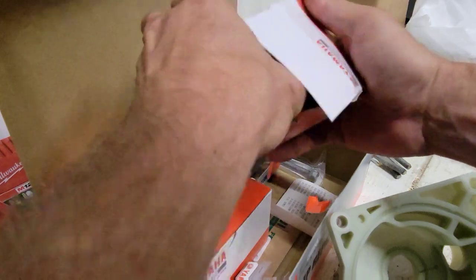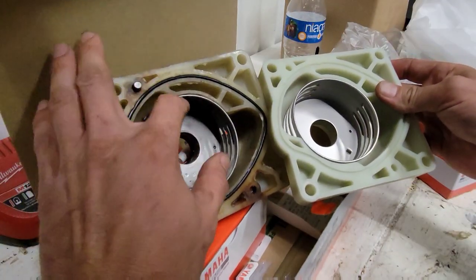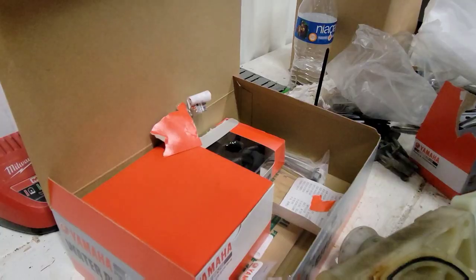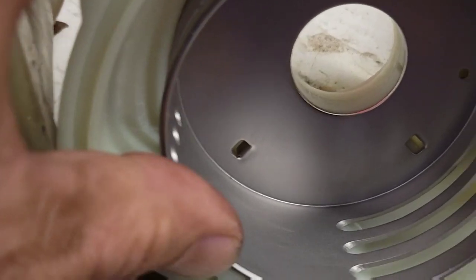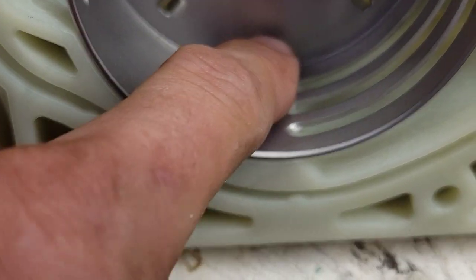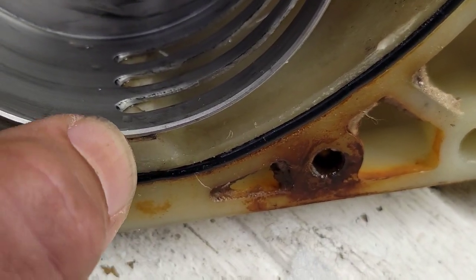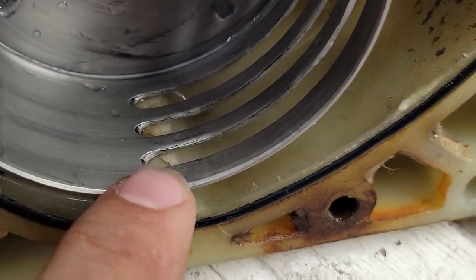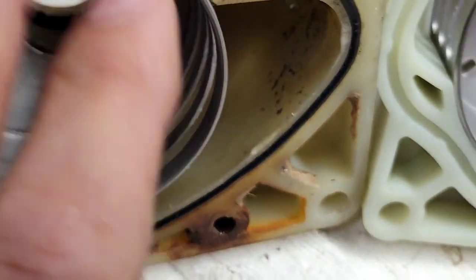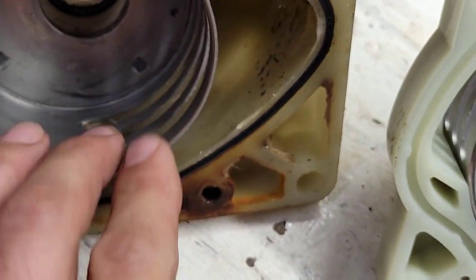I think the problem here is this one shrank, being that it's melted. It doesn't look like anything shifted. Looking at this one, you can see where this ridge is - right at where the outlets would be. Look at here: it's moved, and you can see where it's melted. You can also see more of that rubber material. So definitely could have had a problem here. This could be why we have an issue with intermittent water flow or not very much water flow.